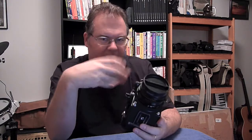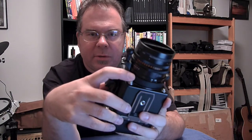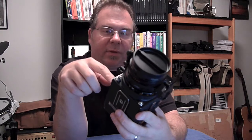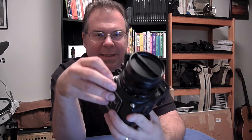The next thing to test is the slow speeds — that's where things go wrong. I'm just doing this by ear. You want to hear a buzzing as the shutter goes, and note that I hold the shutter down the entire time the shutter is buzzing. The Hasselblad has two sets of shutters — you need to hold the shutter button down the entire length the front lens shutter is open, otherwise you'll cut your exposure short. Sounds pretty good. Maybe I'll try a quarter second — sounds pretty good.